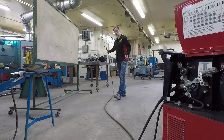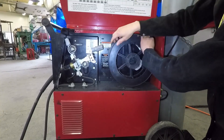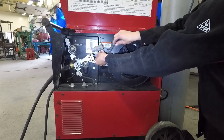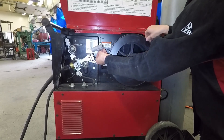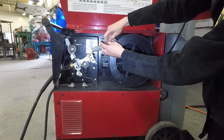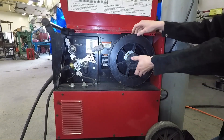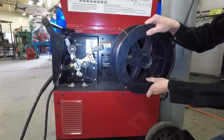Go ahead and make sure it's straight, and just roll this wire back onto the reel. But realize you want to watch the end of this — if you let go of it, it's going to unravel the whole spool. So catch that and just loop it into one of these notches there. Then take the retainer off of the spool and pull the spool off the hub.